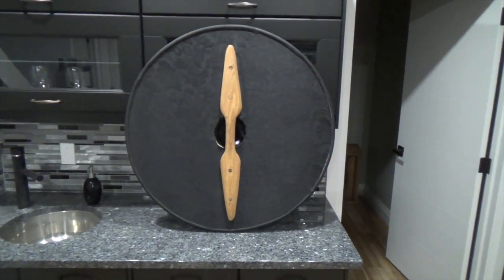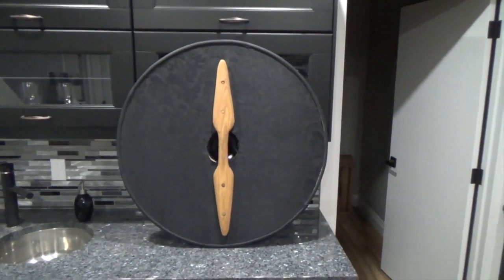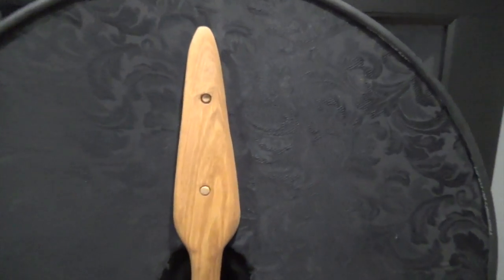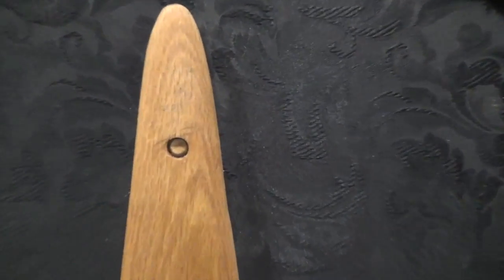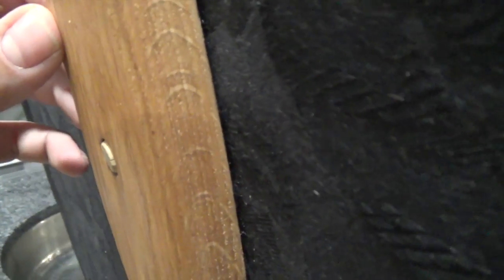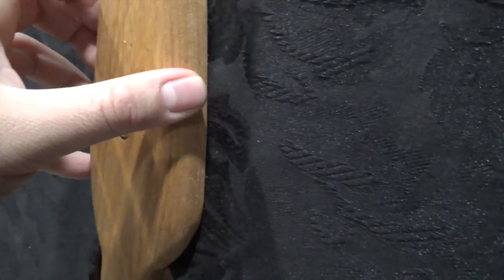Here is the back of my Viking shield. To make the handle, I made it a bit wider and also made it out of solid oak for additional strength. To install the handle to the main body of the shield, I used wooden dowels or wooden pegs. It's a very solid construction. I also used epoxy glue and slightly longer screws on this side to help connect the handle to the main shield.